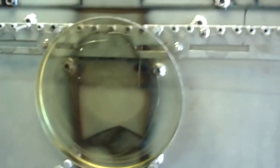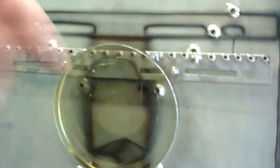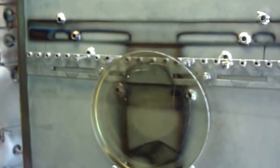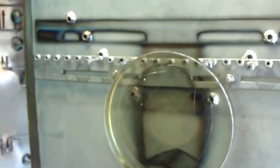Alright, so we're picking up on Dave's 10-inch mirror. We got the aluminum coating stripped off. We still need to do a final really good cleaning to it. We got his mirror, got the aluminum stripped off, dried it off. We're doing a test fit in the chamber to make sure the brackets inside are set up so it'll hold the mirror nice and secure — because it would be terrible to have the mirror fall over while it was pumping down and run into the hard steel parts inside and shatter that mirror that he's probably put a hundred hours or more of labor into.